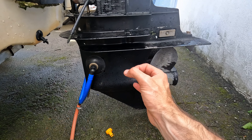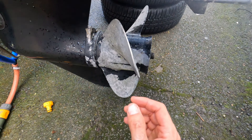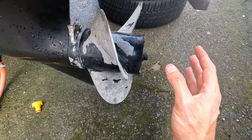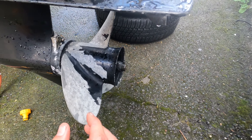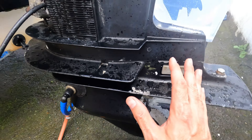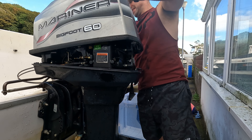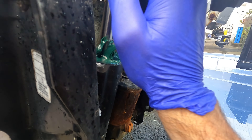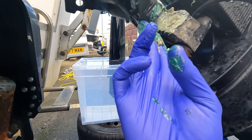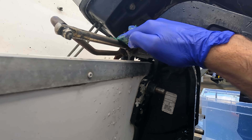The lower unit has been drained and I've put a new magnetic plug in — if there's any metalware it tends to cling to that — and a new washer. I'm also going to take the prop off because in the past I've heard of people getting fishing line stuck on the shaft, so I'll lubricate that and bang the prop back on. As you can see, being 24 years old she's had a rough life around this boat, but look after it and it'll look after you. Tilt reservoir has oil in — I'm just going to add a little bit of grease there and on the steering bar as well.